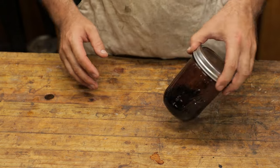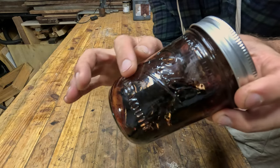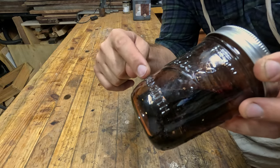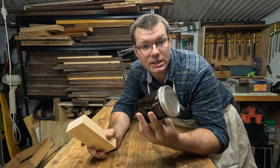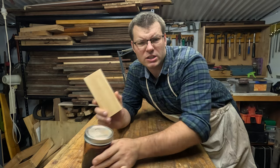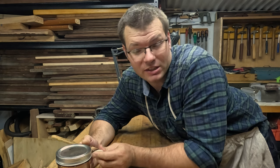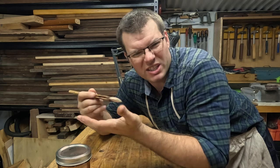Whether it's store-bought or one you've mixed yourself, you can throw a little bit of dye into it. If you look closely at the jar in the lighter part, you can see the colour you're going to end up with on the timber. Obviously it'll soak in and change a little based on the timber colour, but you can get a good idea of how dark it's going to be before you even apply it. Remember, since this is shellac you'll need methylated spirits or denatured alcohol to clean your brush afterwards — especially when using colours, as you don't want that staining your brush.